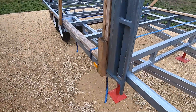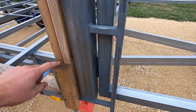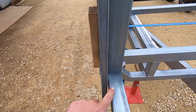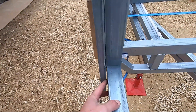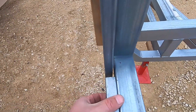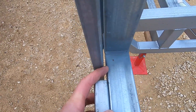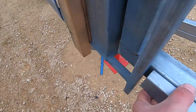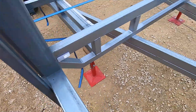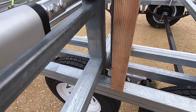I'll be making these walls weatherproof by overlapping them and stepping them on either end. I've added this frame that will have a flashing coming out over the top and around inside here. There's a 5mm gap between the edge of this wall and where that flashing will go, with a rubber seal that runs full length. This wall will then be packed out another 25mm and the flashing will come down over the side and along there. That means there'll be a step in my joint that prevents wind and water being pushed in underneath my seals — same on the other end where my swinging wall meets my wall frames.